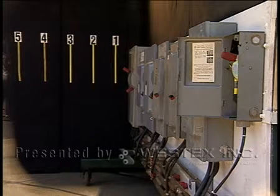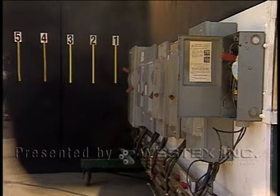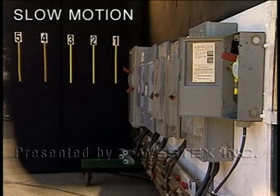This is a 30-amp disconnect, a Category 1 arc, and it does something very surprising. The hazard was not directly in front of this box. The arc, as you're going to see very clearly in slow motion, leaves the box and travels down the bus bar at the bottom of the sled and blows a hole in the ultra-soft fabric wall at the back.